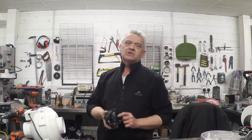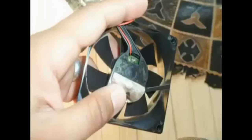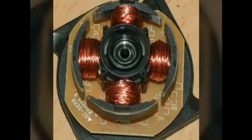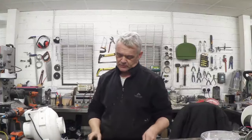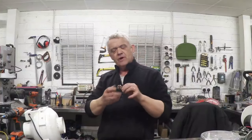I have at least 30 of them and I keep collecting them every time I take a piece of equipment apart. There are lots of YouTube videos on how to convert these to generators, and I've done one myself — they're really quite simple. They're usually held on at the back with a little washer; you pluck the washer off and it comes straight off. Sometimes you've got clips, give it a press, and you'll separate it into the wheel and the back piece. There's the stator, which is the bit that generates, and in the fan you'll see a ring which is the magnet bit that rotates around.